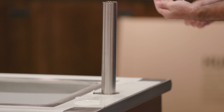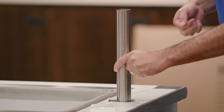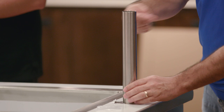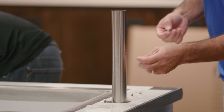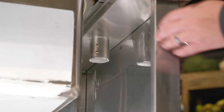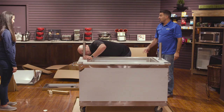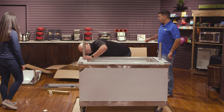In the back you'll be able to see where to put the set screws to hold both of these in place. I would also recommend when you're putting this together you turn the notches outward so as you're putting the top down you're able to see how many and be able to tighten it in. After you set the posts in the hole you're going to have to tighten the set screws with the supplied Allen wrench. So now Lori and I will take the top and get ready to put it down.